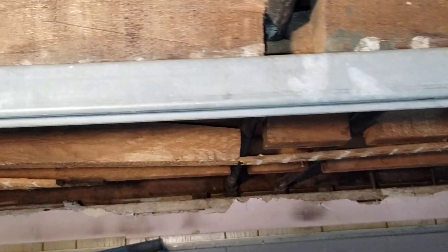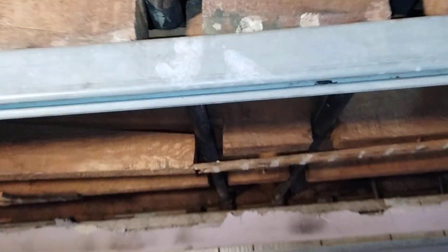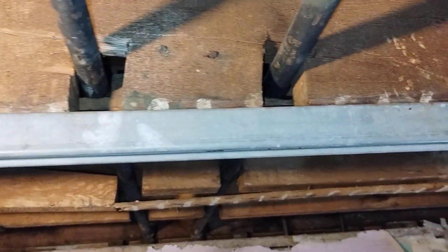Securing that so it doesn't flip around or flip over. That could be bolted and screwed with a little wedge inside, or I could use a plate on one side - a big plate with two-inch square washers on the back side that will press into the wood. I prefer this to be a long-term repair. The plate squashing the wood will transfer the load from the good lumber to the good lumber through the steel.